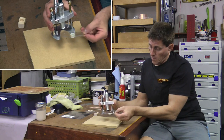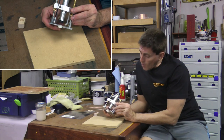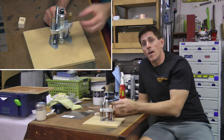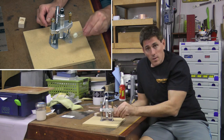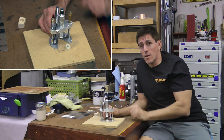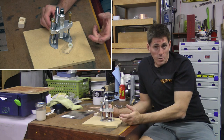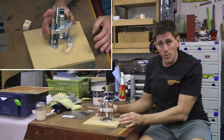So my solution was to create my own little jig that would act like a router guide or router bushing. It simply fits onto the base — you set it up on top, slide it back, and screw it into place. But the problem is, how do we ensure it's centered? With regular benchtop or handheld routers, you normally use a centering mandrel — basically a big bit with a cone tip that you lower into the guide bushing, and the cone naturally centers it in the circle. Here I don't have that option. My collet accepts at most a quarter-inch bit, but I need a larger hole for clearance for the bits I'm using, since some burr bits are bigger than the actual shank.